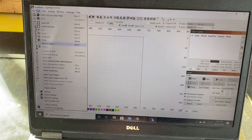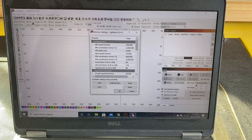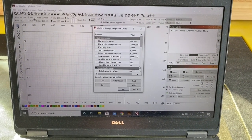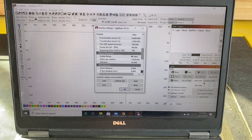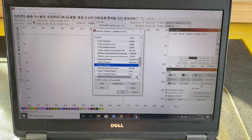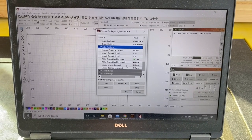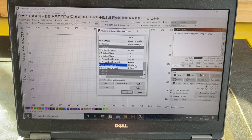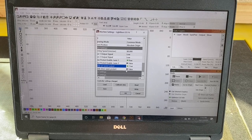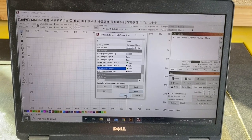We got everything run — blue hose going up, tucked right there, all the way around, and I put a couple little velcro straps here. Down into the regulator, which is hooked up to the solenoid on the back of the laser. Now we'll go over and change the settings. In LightBurn, go to Edit, scroll down to Machine Settings — after your laser has been connected and you know it's working, you'll see that it read the controller. Go down to Vendor Settings, find 'Enable Air Assist Output,' and change that to true, then Write and OK.